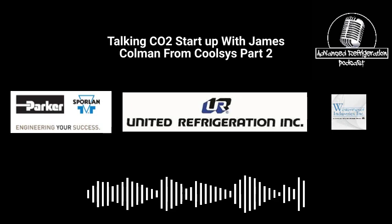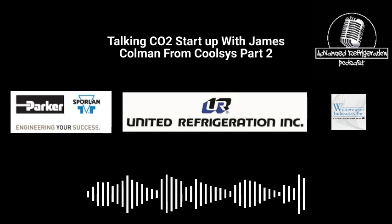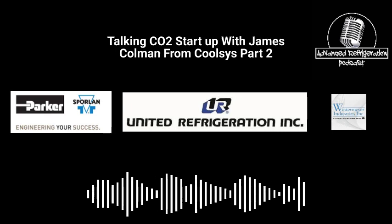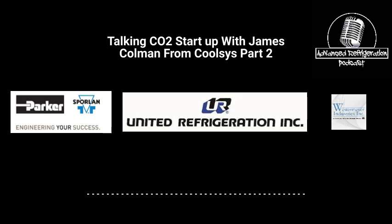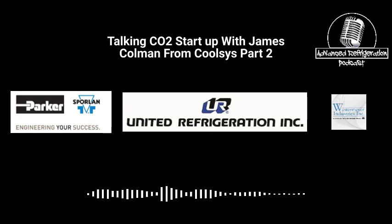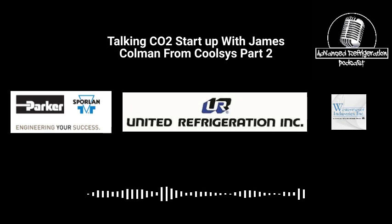How long does it usually take to charge a brand new system? About four hours. I don't dump in the full charge initially in a half hour - I charge a little bit and start introducing more and more load onto the rack as I'm charging, instead of just dumping the full load all at once. Especially with a Hill Phoenix rack - if you dump the full load, the superheat's so high you can actually take the compressors off on thermal. In the wintertime we'll usually let it eat because it doesn't have enough load to cause a problem, but if I'm at a larger store I bring it on a little bit at a time.